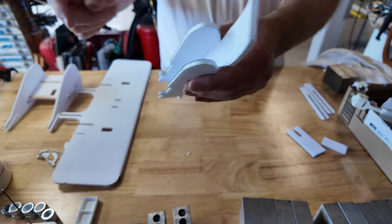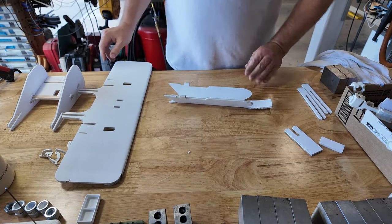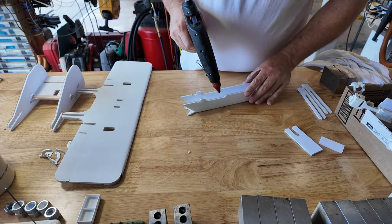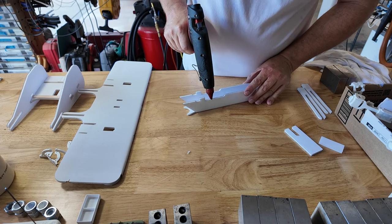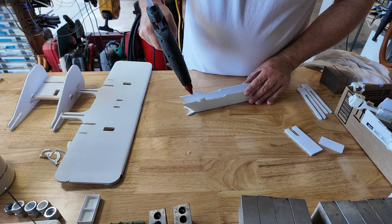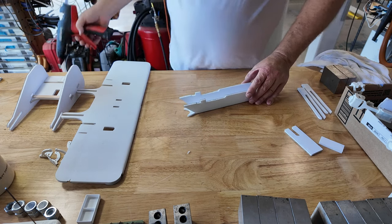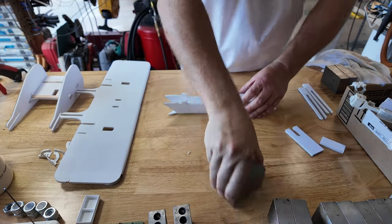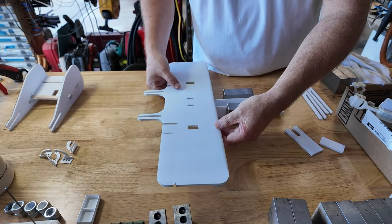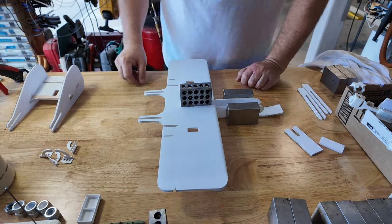And I'm not going to close the back or the front. Why? Because we need to get a bunch of wires in and through there. So why don't we go ahead and do that? We're going to put the wing on now. Little bit of glue up to the tick, on the tick to the leading edge. There we go. Aft at the spar pass through, all the way to the trailing edge. I can block this up like that. And we can pass this through and mount the wing. Seems early, but you'll see why.